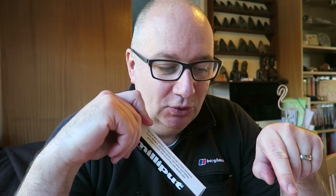Now back to an old friend of mine — Milliput. It's been a little while since I've done a Milliput project, and it's a kind of late addition that I think is really going to give it a different twist, pushing Milliput to another level. For anyone who doesn't know what Milliput is, it's a two-part epoxy putty — you mix equal quantities, knead it for a good five minutes until it's an even color with no streaks, and then squidge it into your recess in your woodturning to produce a perfect inlay.